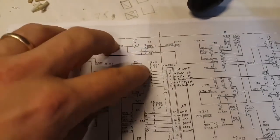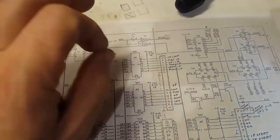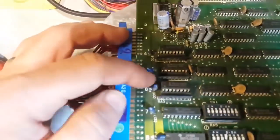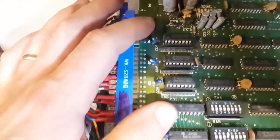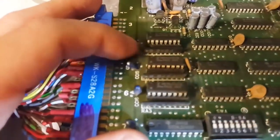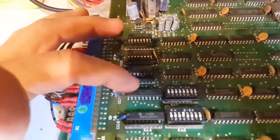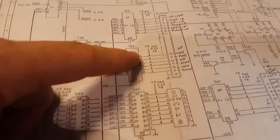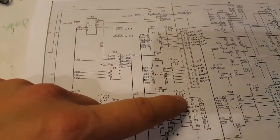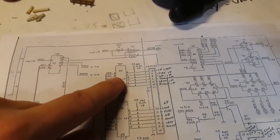In this case, you can see all these connections here. It's not a separate resistor, it's a resistor array bank thing. I assume it's one of these chips here. We'll know exactly which one, but you can see you have the chip and the resistor. It says 2.2 kilo ohms here, and 2.2 and 4.7. So there are three of these chips and three resistor arrays, which is consistent with the schematics here. So 2.2, 2.2, and actually 2.2 here on the board. It's a 4.7, interesting. Never mind.